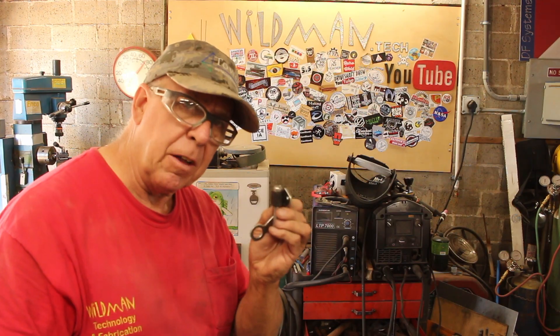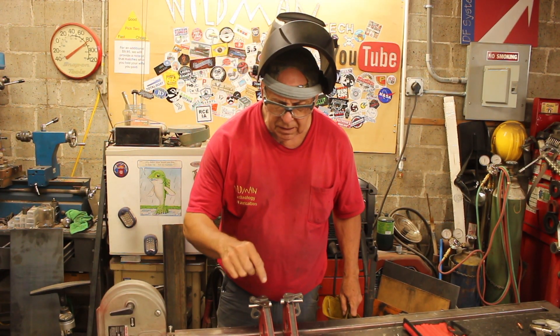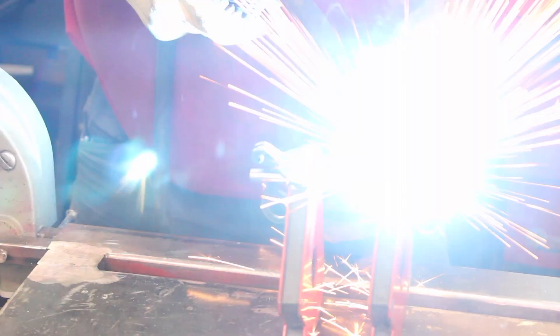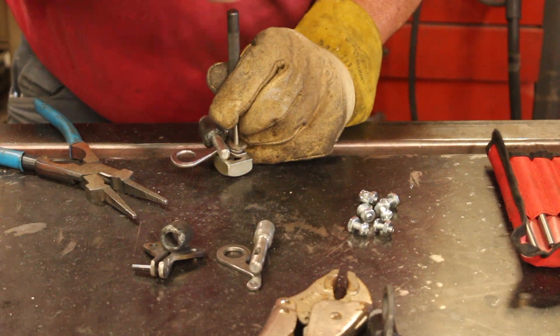But before I do that I've got to make another one. I've reconfigured the welder back to MIG configuration and just welded these two together. Those turned out looking pretty good. Now I've got to take them back apart and paint them. Something I learned from David Picciuto — and he doesn't even know he taught me this — is if you paint this stuff while it's still hot it will dry instantly.